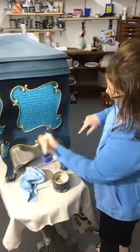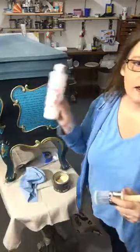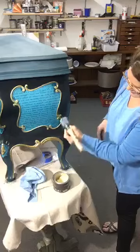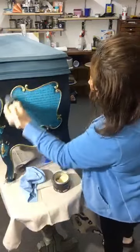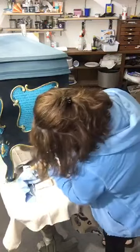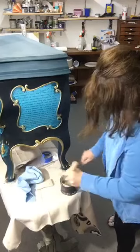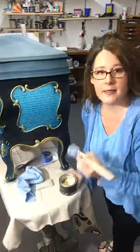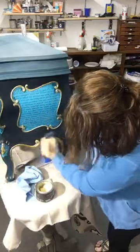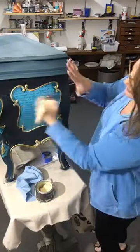All right, so this right here, this color was already changed, which you probably couldn't tell. Before I put that transfer on, just to try it, I sealed with this top coat. It's one of the ones that I sell, which is why I chose this one. But in doing some testing and some research and development and just playing with products, we are finding that the transfers stick better over a universal sealer, and something flat, not something with a sheen. That said, for the last 4 years, I've put transfers over my paint and I've had no problems with them. Some of them I've kept because if I'm selling this to customers, I want to know how well this is wearing. How are my products holding up? So this is the second time ever that I've sealed before the transfer. That's why it was a different color. I must have missed sealer where it's that color, but it'll all even out.